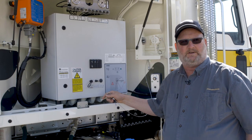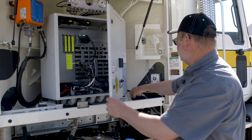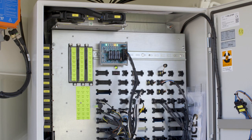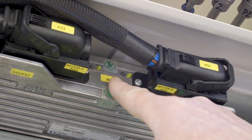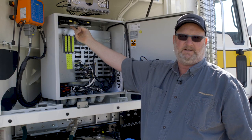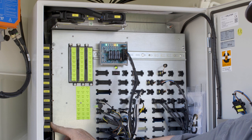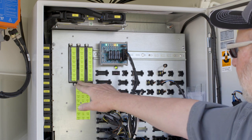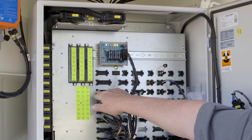Another change with Ergonic 2.0 is inside the control box or combi box — the system is a lot simpler. You'll notice a lot fewer components inside. For example, no e-stop relay. We have two processors working in sync; as long as they both agree, this is part of the safety circuit for Ergonic 2.0. These are the computers operating the entire system. We still have the need for high current relays. Our primary power relays are located on the left side of the control box, and fuses are in the middle left, all labeled to identify their position and page relationship on the schematic.